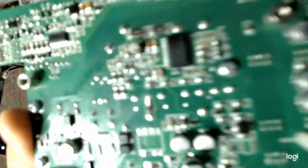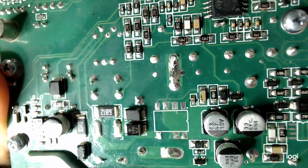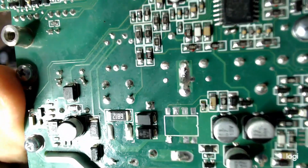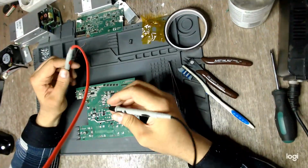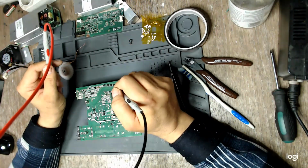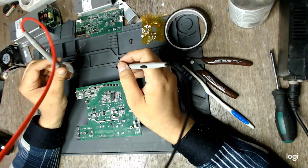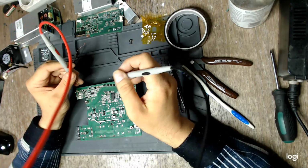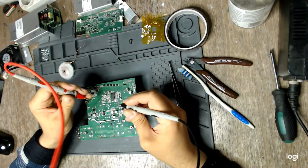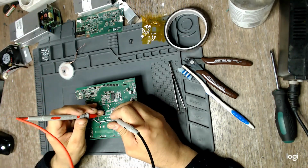Did we do any damage here on the pads? No. Everything seems okay. Even that tiny resistor, right? Why didn't I get my reverse diode on the driver? It couldn't have been from desoldering it. I didn't heat it up that much. Certainly not enough to damage the diode. So, was that diode something on the board?